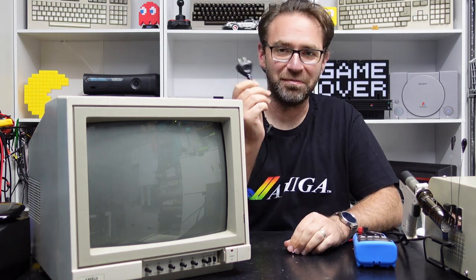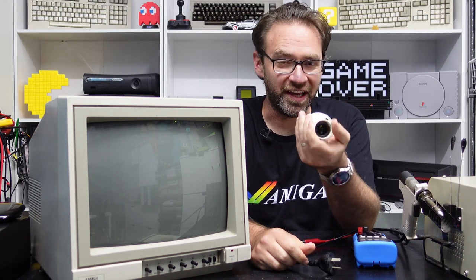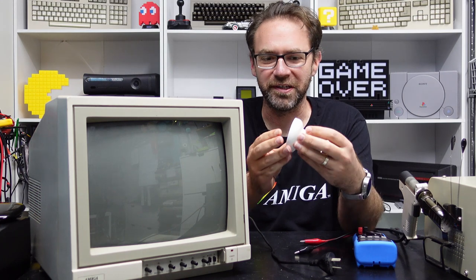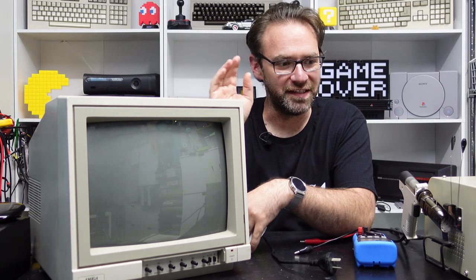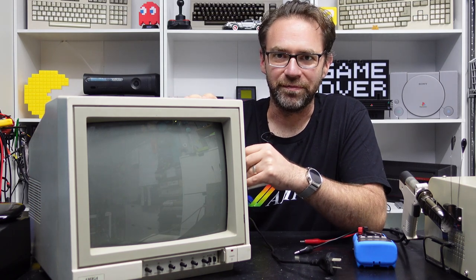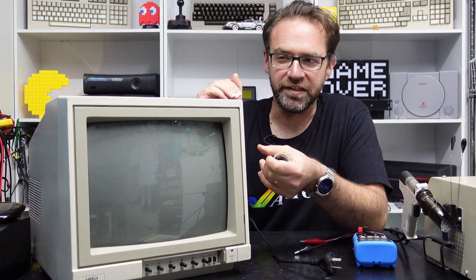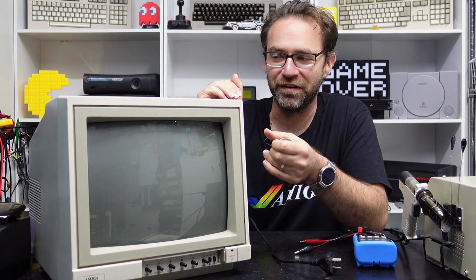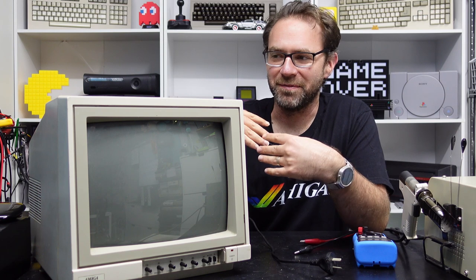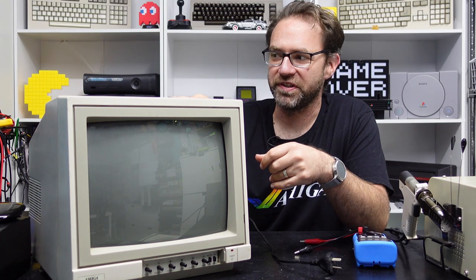I'm not actually going to plug this in yet. What I want to do first is build a series resistive load using an old incandescent light. I haven't got one around the house so that's something I'll need to pick up and build. The reason I want to do that is because both the 1084 and the 1081 — I don't know what the state of them is, and if there's a short somewhere, say the horizontal output transistor is shorted, I don't really want to let the smoke out. A series resistive load is a really cheap and pretty darn foolproof way of making sure you don't do that. I also want to get an isolation transformer — not only to protect myself but also to protect the equipment, because no doubt we might have to break out the oscilloscope and you don't want to connect a scope to something that has a live chassis.